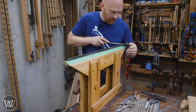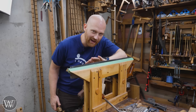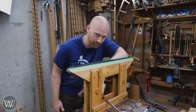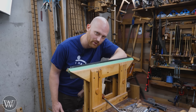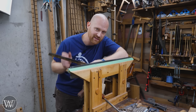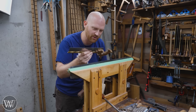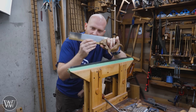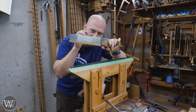And just like that, we're done. The actual sharpening on this one only takes about three or four minutes — it's pretty quick because they're big teeth, easy to see, which is also why I picked it for the camera. It's going to be the exact same process for something small like a dovetail saw, but that has way more teeth even though it's so much smaller. Because they're smaller, they take more time to visualize and you need a smaller file — a dovetail usually takes me around 20 minutes to sharpen, whereas this goes really, really quickly.